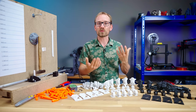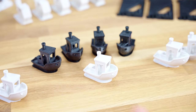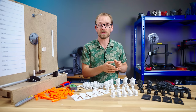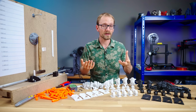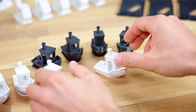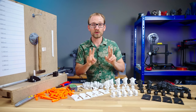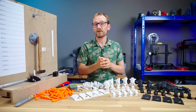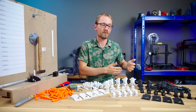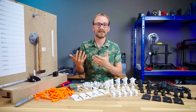What seems to be the generally agreed-upon understanding is that there is a normal print temperature for any filament — 215 for PLA, 230 for PETG, and so on — and that is generally the one you want to use. But if you want parts that are stronger and welded together better, you choose a higher temperature, and if you want parts that look more crisp and less blobby, you choose a slightly lower temperature. But there are two problems with this. First, if you print hotter, you're not just getting better layer welds — you're also thermally degrading your filament. With ABS, you're actually specifically boiling off some of the components that make the filament tough and slightly flexible.